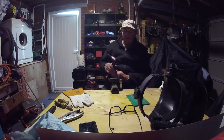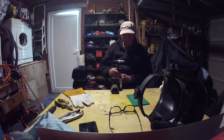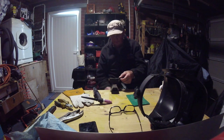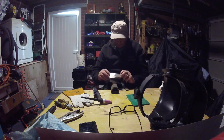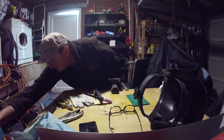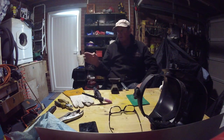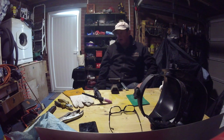The arc was all over the place. There's nothing you're going to see with that anyway. And I don't think there's enough heat in it — it's not even pushed through. Too low. So let's go to around 35 amps. I want to put it onto a line so I can use it again if it's right. It's turned out now to looks like 35. Let's see what happens.